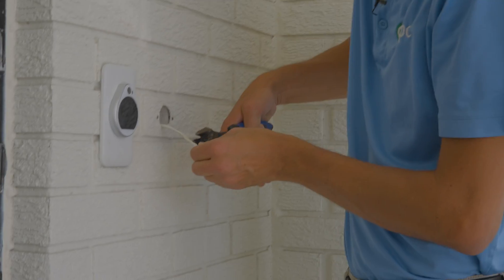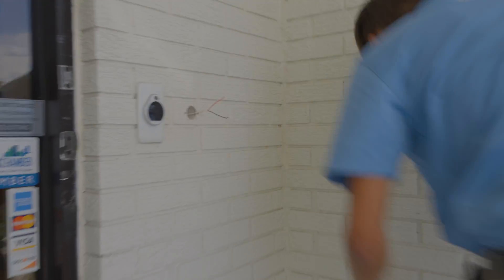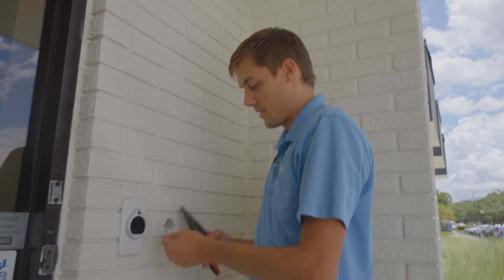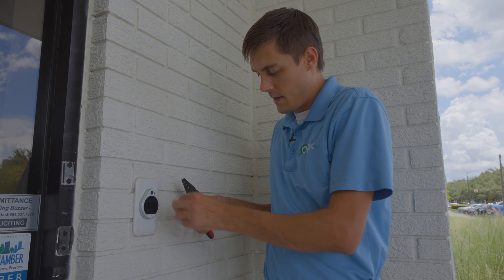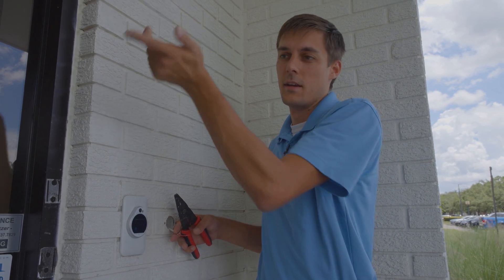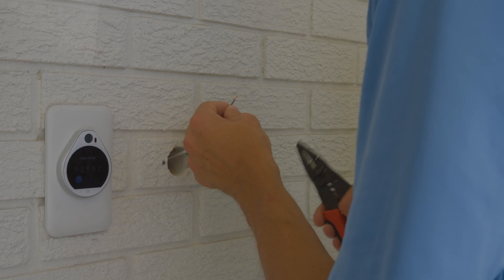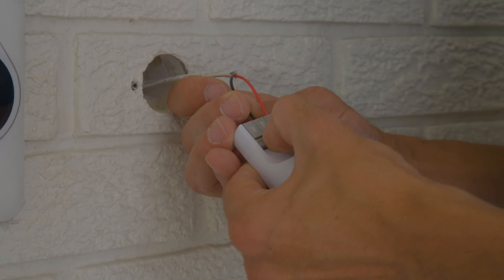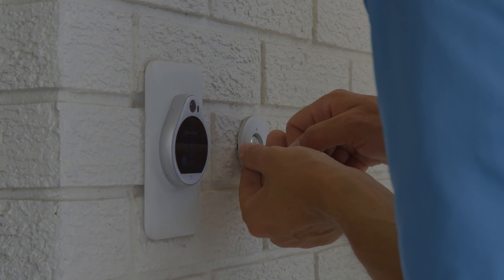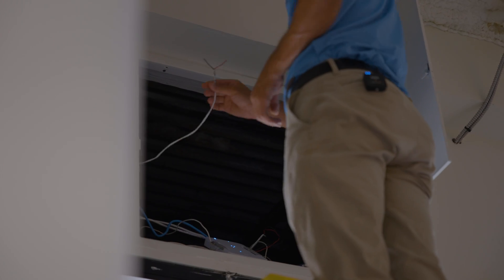Okay, I need to take my wire. This one wire has the red and black. This will be going into the normally closed side and then the common side — and that runs right up to our access panel. When you push the button it unlocks the door, or turn the key. Our door is always closed, so normally closed and common. Pretty easy — just push a little tab down and they slide right in. Now I need to go up top and splice the wires, put them into the connection ports on the UniFi access panel.